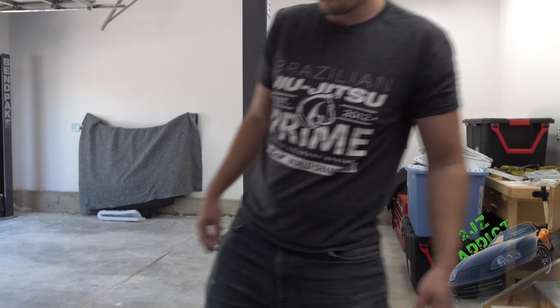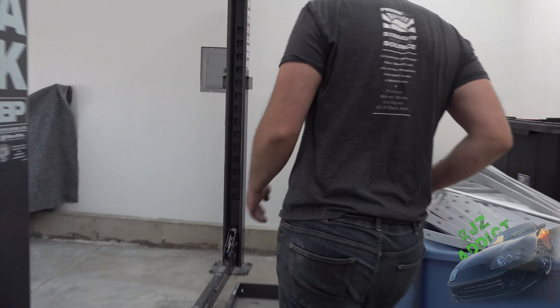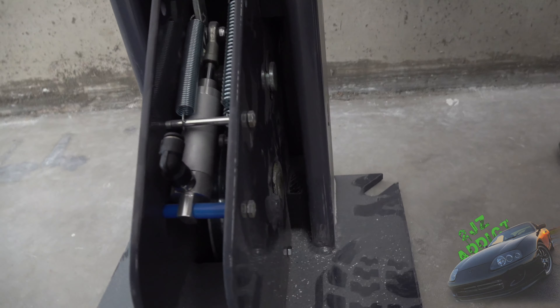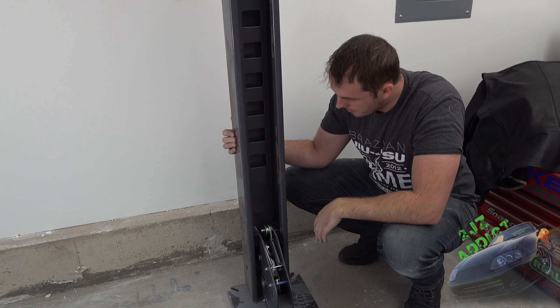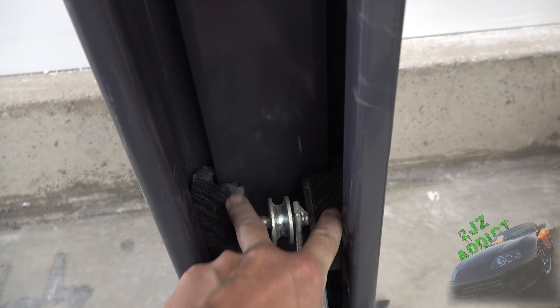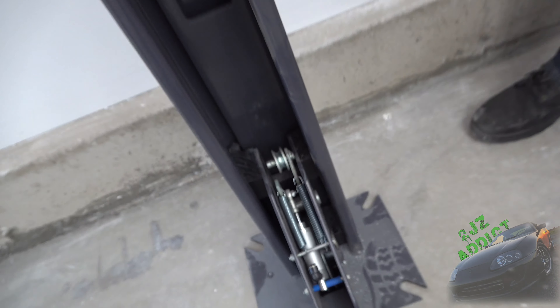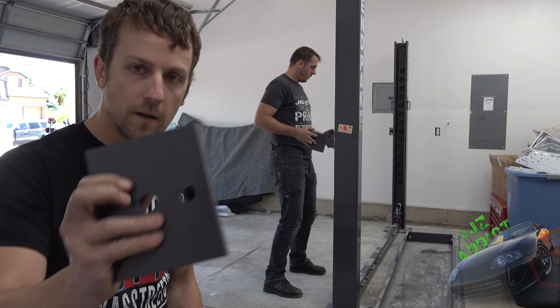To get this in, we had it lodged between the end of the plastic bushing and the inside of the frame. We just had to unwedge it — press towards the middle to cause it to bow a little bit, and that was enough to slide it into place. Make sure you've got grooves on both the top and the bottom.